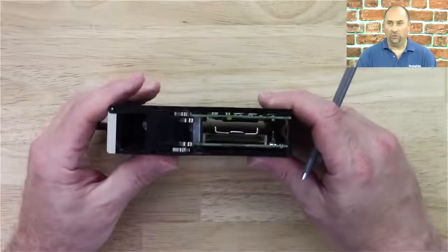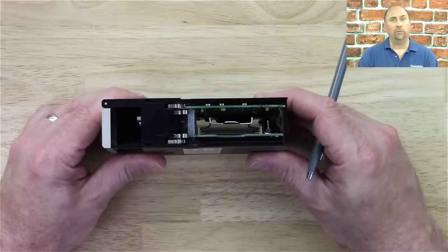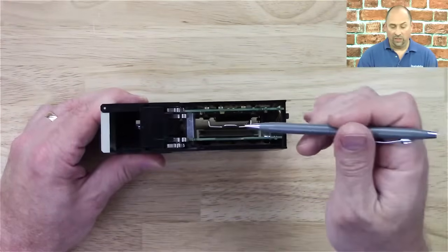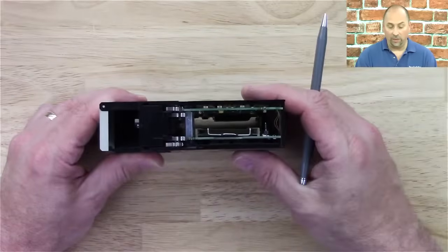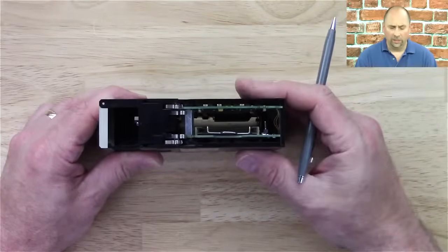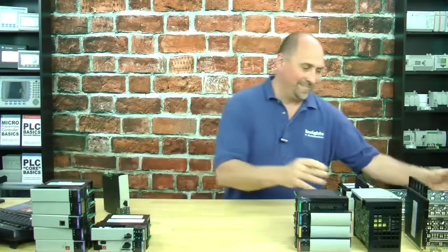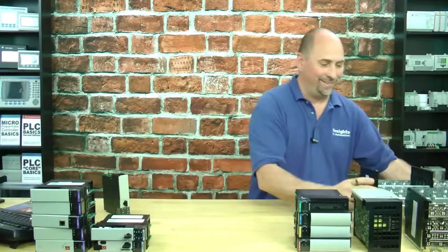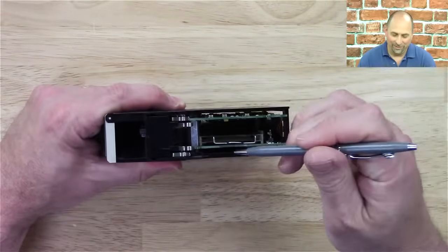If we look at the bottom of this unit, we'll see that it's a little different, because instead of having a modular memory board, when you buy an L6, you buy it with a set amount of memory and you cannot expand it. However, the advantage is that you can now use a compact flash card for your non-volatile memory as your EEPROM, as a way to store a second copy of the program in your processor, or as a way to send somebody an updated program easily. The bad news is, like the original PLC-5, it's in the bottom of the unit. If we take a look at the chassis here, there's no holes — you can't put that in while it's plugged in.